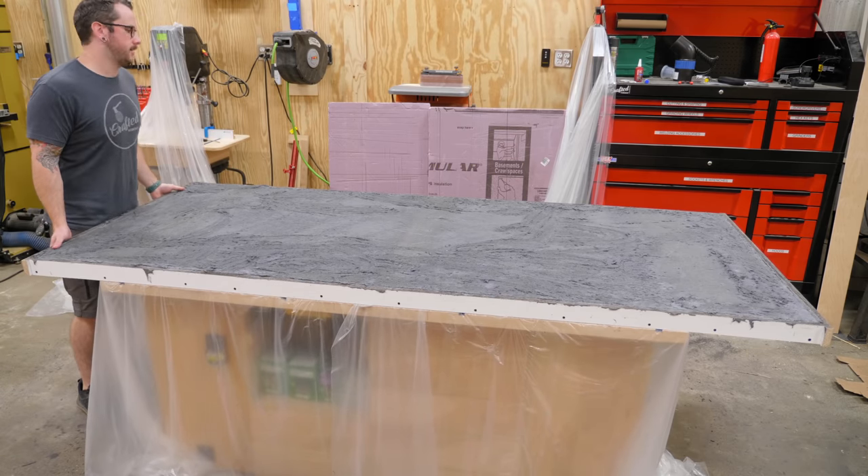With the grinding done, it was finally time for the moment of truth — removing the form. This is definitely the most exciting and nerve-wracking part of any concrete project as you really don't know what your project's going to look like. Overall I was really happy with how clean the edges were. Definitely not perfect, but I was going to grind those sharp edges on the bottom off anyway. I pulled out the grinder again and knocked off those sharp edges, basically chamfering the bottom edges, then blew off any excess dust. Then it was time for kind of the real moment of truth: flipping the table over to see the top. Thankfully this went smoothly and the top surface was incredibly smooth.